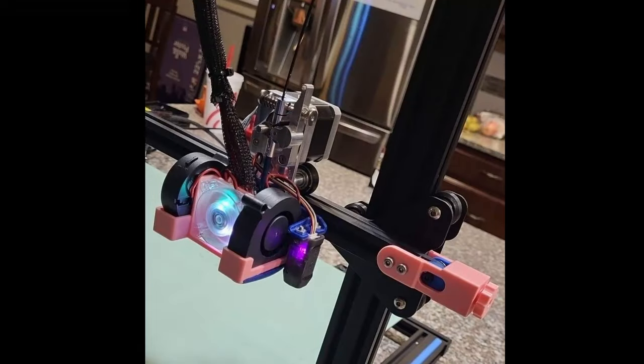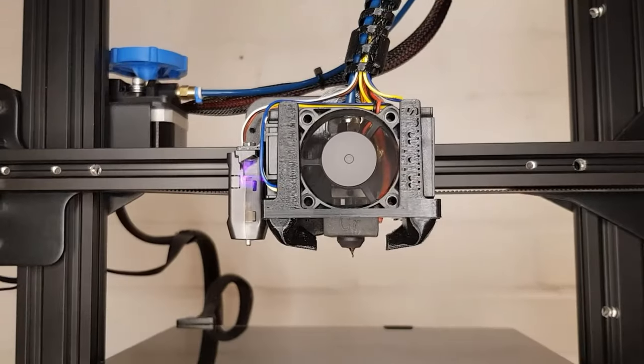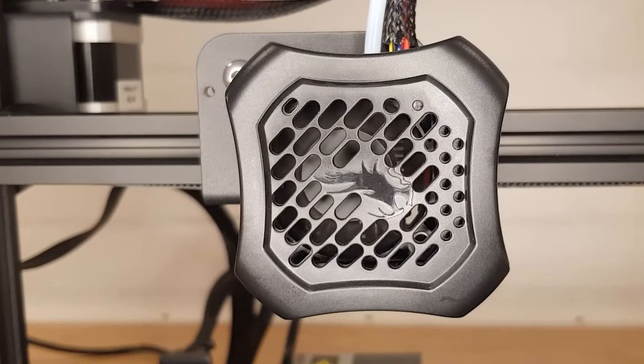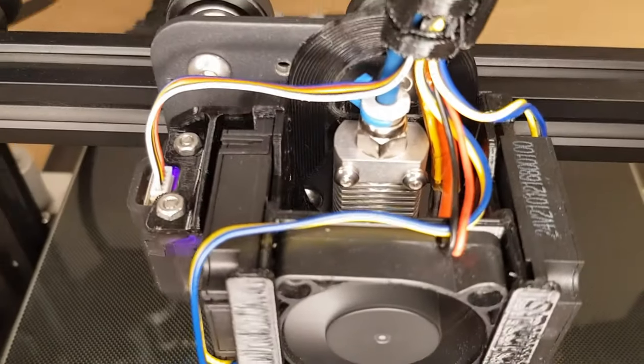That's impressive. If you don't like the standard Creality units then the Minimus gives you options for using different size fans, and as I've mentioned you can add an additional part cooling fan and duct that blows on the other side of the nozzle. This ensures that there are no blind spots when it comes to cooling extruded filament. What Paul's design also does is direct air over the hotend heat sink that you want to stay as cool as possible, whilst also directing it away from the heat block that you want to stay hot. Many designs including the standard hotend cover just blow air in the general direction of the hotend and hope for the best. In basic terms this should help your nozzle heat up quicker and then use less energy to stay at the correct temperature while printing. So the hotend cooler gives easy access, options for better part cooling, and it should give better hotend cooling efficiency without the usual penalty of additional weight.